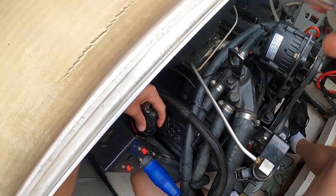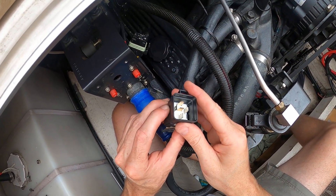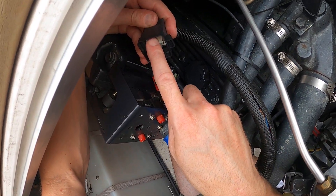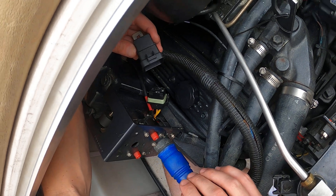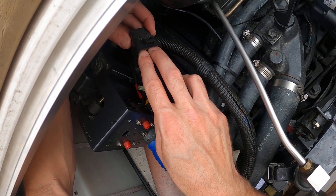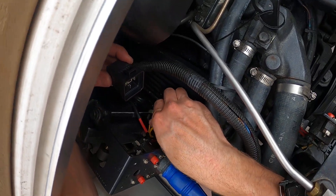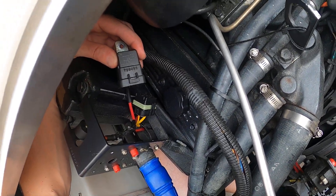There's a little silicone gasket in there. The terminals inside the relay all look pretty good; some of them look kind of scorched. How this relay works: in this orientation, you can see the yellow with red trace wire is the signal wire that goes here, and the opposite side is the negative black wire — that all comes from the harness. Between the signal wire and the ground zero volt, that's what pulls the coil in, and then it passes power from the red across to the yellow wire that goes down to the starter.